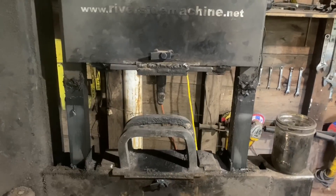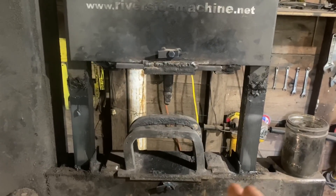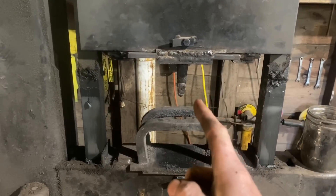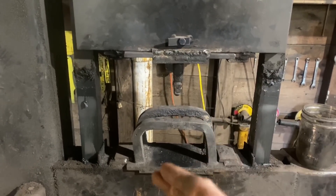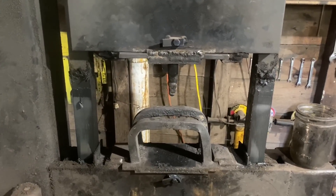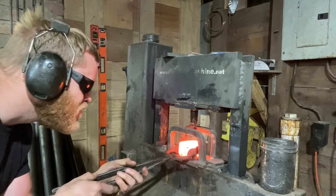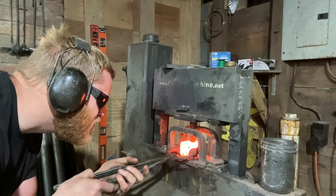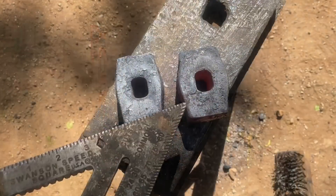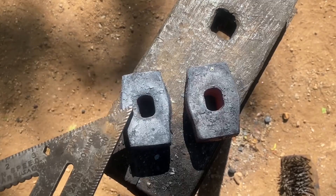Alrighty, I got my punching and stripping die set up. I'm going to mark the center at the anvil with a hammer eye punch off camera, just so I've got a point of reference. I really can't overstate how careful you need to be with this material, because as H13 cools, it contracts pretty aggressively, and if it gets stuck on that punch, I have actually broken that punch three or four times trying to rush with H13. So I got some charcoal powder there — hopefully that'll help. Slow is smooth, smooth is fast. Alrighty, we got our eyes punched. On a hammer this size I would do it in one heat, but with H13 being such a difficult material, I did these in about four heats. So we're good to go.